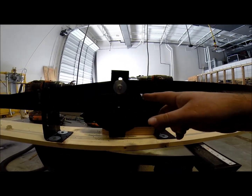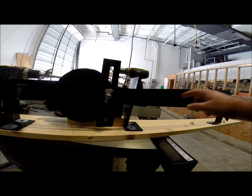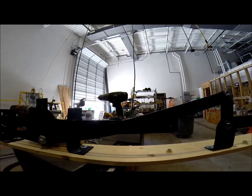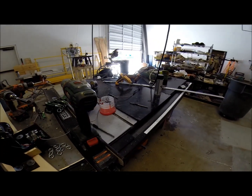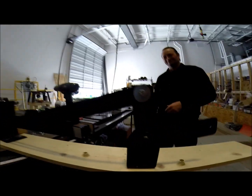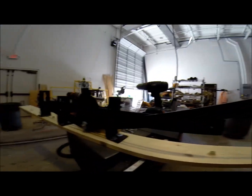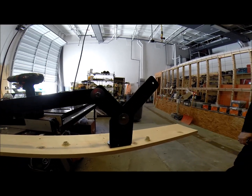Also attached is a bell crank. This arm here is attached to the post — it goes all the way out. All this is built out of ABS plastic, by the way. We started with a sheet of plastic right over there and cut it up with Dremels and whatnot. But basically as this post goes around, I'm converting that rotational motion into up and down motion via this bell crank.